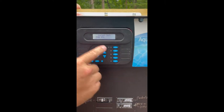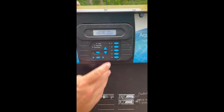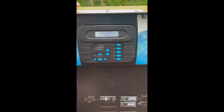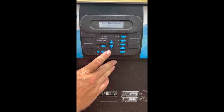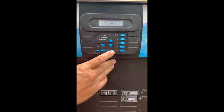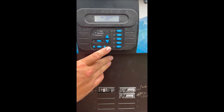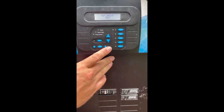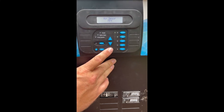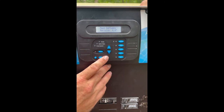Press right and up to save, and where it saves that salt level is to the default menu, so now you're seeing your instant salt level. Flow switch flow means water is flowing through the system. Next we have your cell temp sensor, your water temp sensor, and your air temp sensor. Depending on where the air temperature sensor is mounted, you might get a ridiculously high number because it's exposed to direct sunlight — don't worry about that. We rely on the water temperature and the cell temperature for freeze protection. And then your software revision. That is it for your menus.